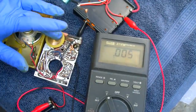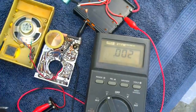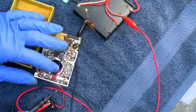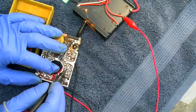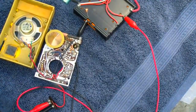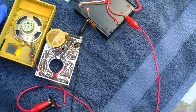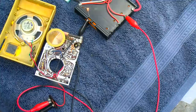We also have this crackling issue. This thing looks like it was exposed to some moisture — it's got some crusty buildup. Let's try and get this audio output issue solved. The bias is very low; it should be around 600 millivolts. With the positive lead connected to the center tap of the transformer and the emitters tied together and to ground through a resistor, these are obviously NPN silicon transistors. It seems like the one on the right is shorted. Let me get that transistor out and test it.